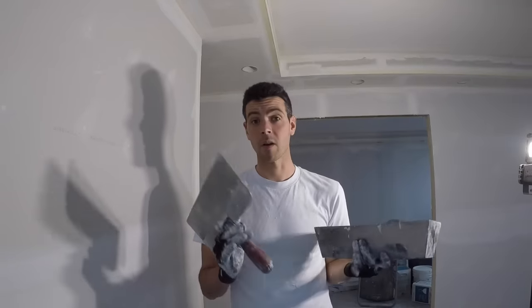Hello and welcome to Vancouver Carpenter. Today I'm going to be teaching you how to coat a butt joint. A butt joint is where the two four-foot ends of the drywall meet, and after you tape it, it creates a humped joint that you need to float out really wide to be able to hide it.